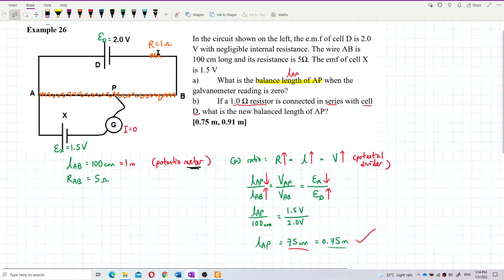This 1-ohm resistance is also in series with resistor AB. Because it has only one leg connected to resistor AB and the other leg connects to the battery — same as resistor AB. So resistor 1-ohm and resistor AB are actually in series.